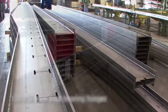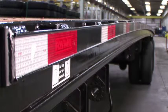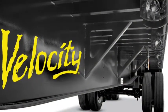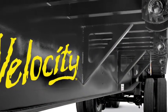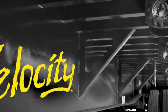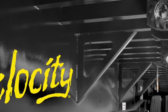These fabricated main beams are made with positive camber in order to accommodate expected loads. The Velocity features one-piece fabricated steel side rail braces and supports which are spaced approximately 60 inches apart. These serve dual purposes: both to strengthen the main beam web as well as providing heavy duty support for the outer side rails and deck.